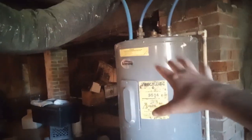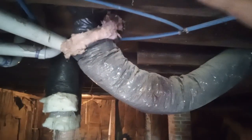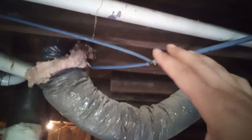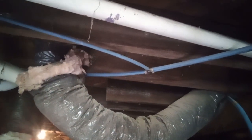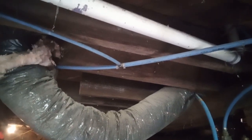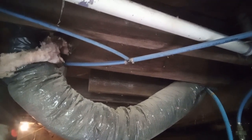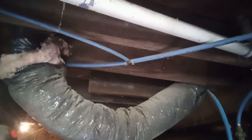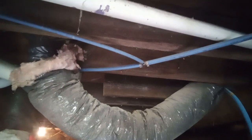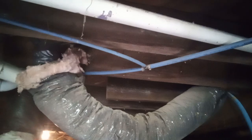The spin-down filter is going to be plumbed in after the water heater to catch any crud that comes out of the water heater once my softener gets hooked up. I'll be able to drain it from there — it's gonna help protect all my mesh and keep it from getting filled up with crap, because it's one thing to take the end off a faucet and clean the little mesh out, but it's another thing to have to pull out your heavy washer from a tiny little nook and undo the plumbing.